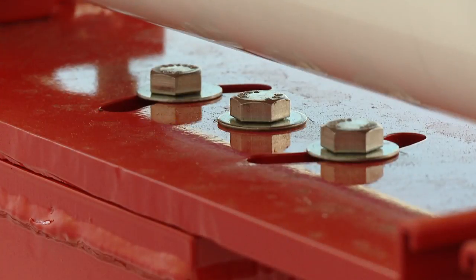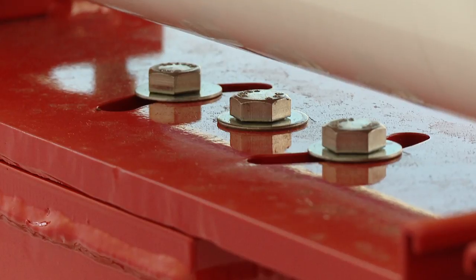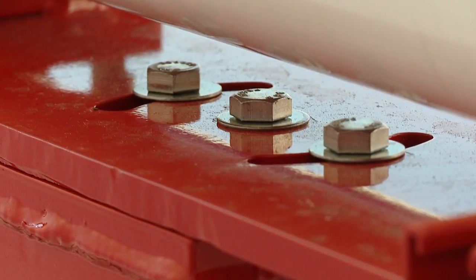It's designed and engineered so that if you go from 90-degree parking spaces, you can turn these and pivot them on a 45, and the bracket and plate that holds the vacuum piping up above is slotted so it pivots and keeps the vacuum line running straight down your sidewalk. So we don't have to make any special design — one size will cover all your different applications.